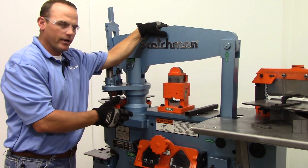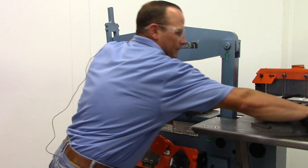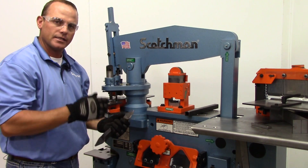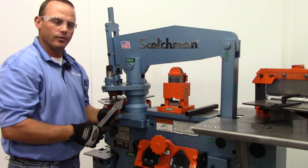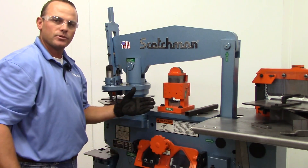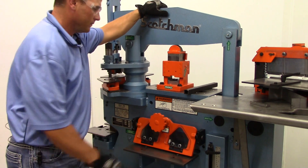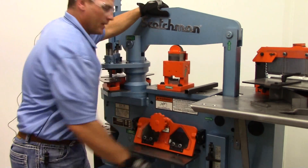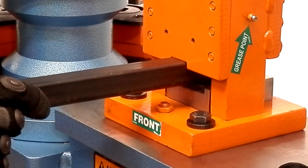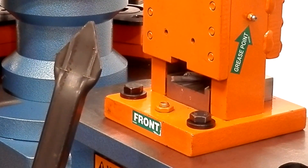Here we are again at the tool table area. We've got another tool that's very popular in the fencing industry — this is what we call our picket tool. We're going to do some samples; your finished product is the top of a picket fence. This particular tool is going to smash and trim the material. We make these dies for half inch, three quarter inch, or one inch material. We set our stroke for the tooling to increase efficiency, stick the material in until it hits the back stop, cycle the machine, and there is your picket. Quick as that.